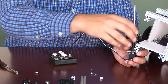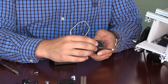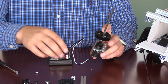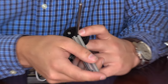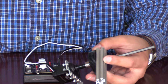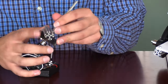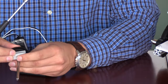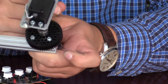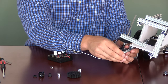With this done, you can slide the entire lever arm as it currently exists off of the shooter apparatus. Then you can take two of the longer bolts and slide them into the 60 tooth gear as shown. With this done, you will take the piece of corner cut extrusion and slide it onto the bolt heads. If the corner cut extrusion does not slide on easily or can't slide on at all, then you've probably set the extrusion and the bolt heads at the wrong position. We will tighten down this part of the lever arm using two of the nuts. With this form of the lever arm, you should see how it is attached with the two bolts tightly tied down, and the corner is very much flush with the edge of the wheel.